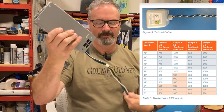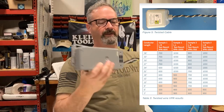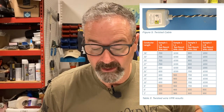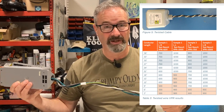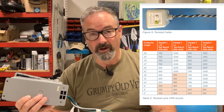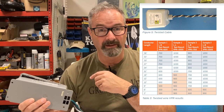These are number-ten wires — they are not easy to twist. But if we twist them up, what happens is: at a 36-inch lead length, instead of having a 1,200-volt VPR, it drops down to 700 volts. Even better: looking at the table, if the leads are 24 inches long — which is realistic depending on the panel and framing — and we have twists in the wire, our VPR drops back down to 600 volts. That's a win.